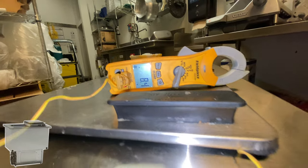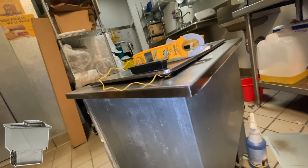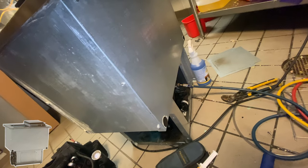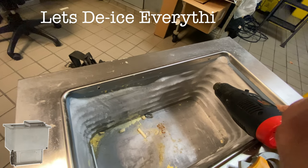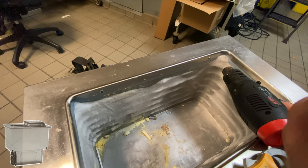Okay, the only way to find out is to recover it then. I thought the pressure should be around 10 psi on this thing. Let me recover it, see how much charge I get out of it, and then charge by the scale, because obviously someone worked on it. Or is it the compressor not pumping properly, just bypassing internally? They don't want me to recover and recharge. It's too expensive.